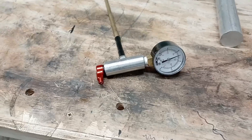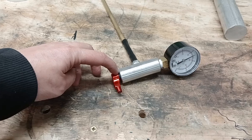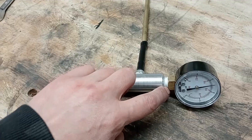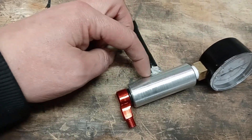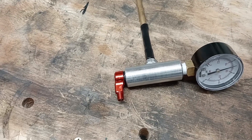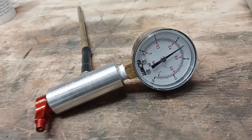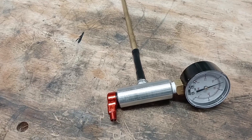Okay, test fit. Everything's plugged in, wound it in. I've used an extra O-ring — I've got an O-ring kit, so I've put an O-ring on there as well to help it seal. PTFE on the gauge at the top, and then this little barb I've put in again with PTFE tape. I did have a bit of a leak round there. I may mill this a bit flat because I think it's where it goes down — it doesn't cut in as well and I'm losing thread. Hopefully that should hold pressure. It seems to be — it's stuck at 7.2 and it's not really moved, so I'm going to call that done.